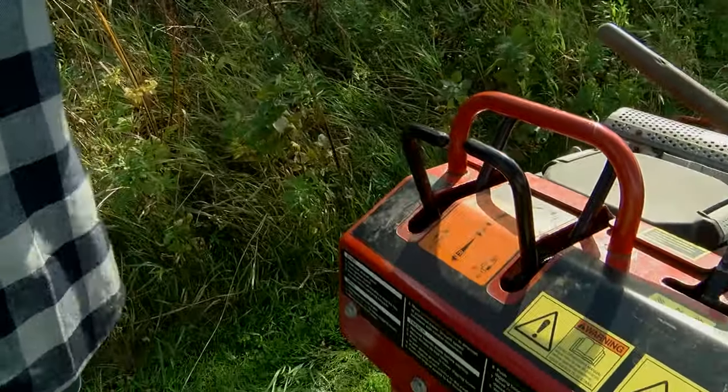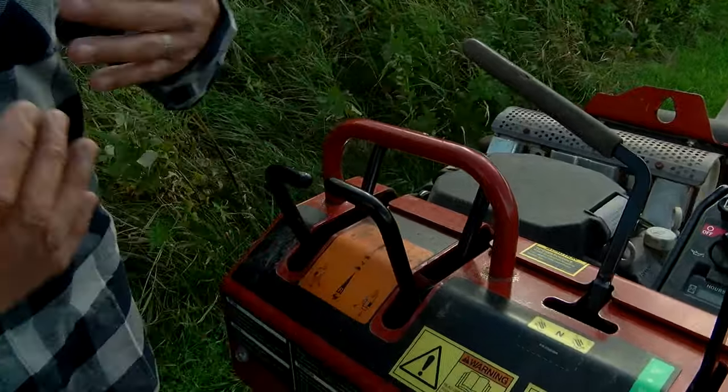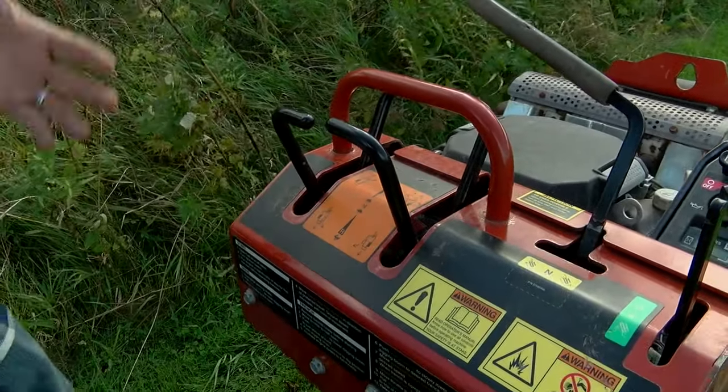When you start digging, it's important to plan for straight lines — wherever you're digging, you're going to go in a straight line. If you've got a turn, you stop, get it out of the ground, and then go the other way. People try to turn with this thing and you break the end — the last guy, it cost him $2,500. So plan out your dig first, which way you want to go, then get it in place.